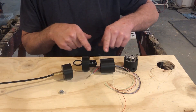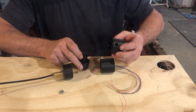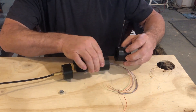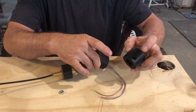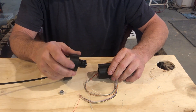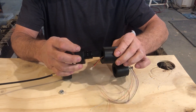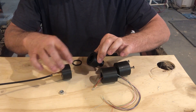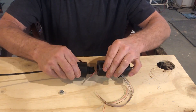This is the slip ring assembly disassembled. This piece here is the end cap — these three bolts hold it to the spool. These wires join through here through a penetrator that comes through right here. That rotates, shoves inside this hole, the o-ring seals, and it can rotate. The wires then go through this hole, come out here, and this cavity is where the wires are connected. So then it turns like that — that's how it works.